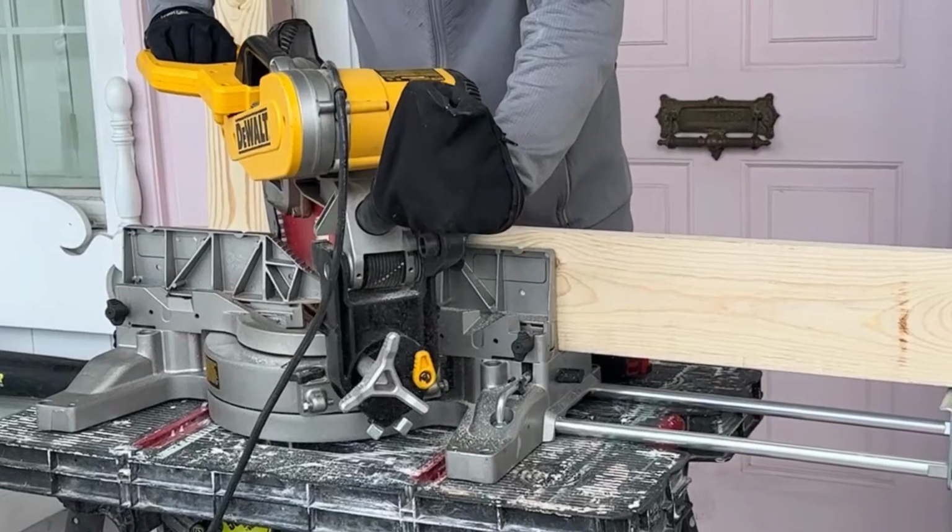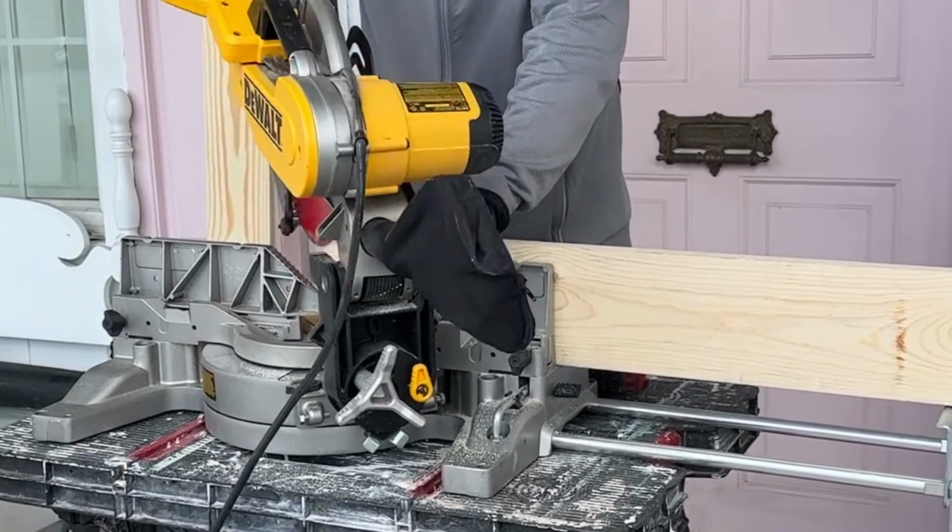What we need to do first is to create an insert to go into the wall. And this is kind of like making a little mini bookcase if you think about it like that. So measure the hole you have, and then we are going to start cutting wood. So we are mitering our corners on the frame we're using. So we're going to have boards on the top, bottom, and two sides. You're going to want the outside of your frame to be a tiny bit smaller than the hole you have in the wall. So get those dimensions and start cutting.